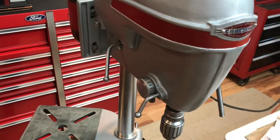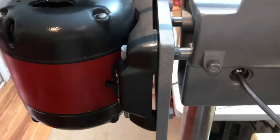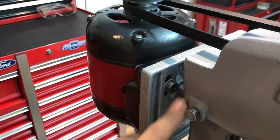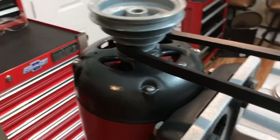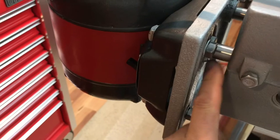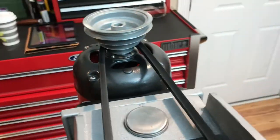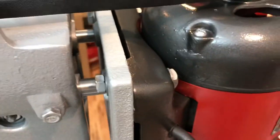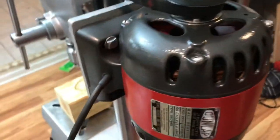Just wanted to show you the nice switch on this motor and this is the piece that swings out when you want to put tension on the motor. The problem was they had a belt that was one inch too short — the new belt I got is an inch longer. They were always banging on the motor or prying on the pulley to get the belt off, and that's what caused all the damage. I had to sand out the pulleys from where they were prying, and JB weld the cracks in several spots inside and outside.